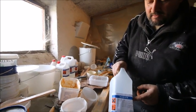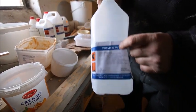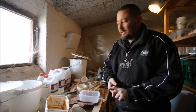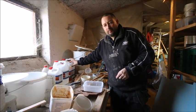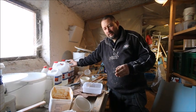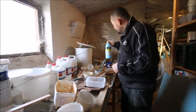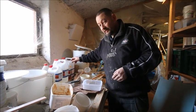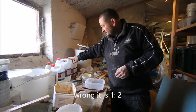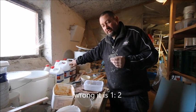I'm using LKR epoxy, and the one I've been using most is the Primer 90, which is a good all-round primer for gluing wood. I mix it one part primer to one part hardener. When priming before gluing, I add a little bit of alcohol into it.